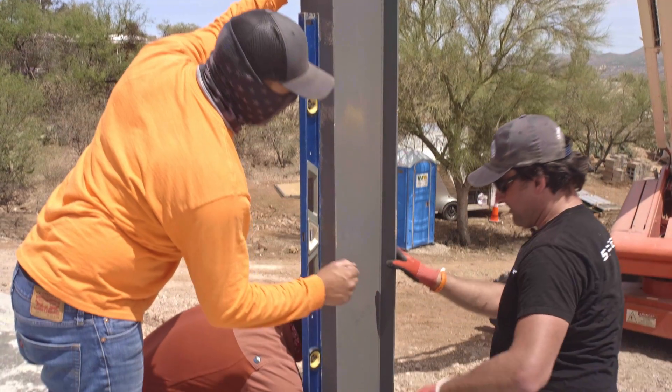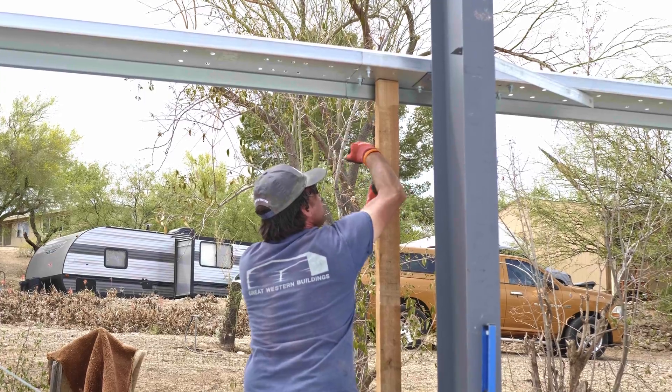I know my customers — some will say they can tell it's level enough and aren't going to rent a transit or laser. Fair enough. If your building is small enough — and this is not advised — you can set up your columns, install your girts, and check the elevations with a long level placed on the girt, then shim as necessary. Keep in mind that girts are not there to support any vertical loads; the eave struts and rake angles are what support the weight of the wall, and the girts are only there for wind loads. This means they can sag in the middle, especially on wider spans. To correct for this, run a string line down the length of the girt at the web, then cut some dunnage from shipping or a two-by-four to the exact length to place underneath the girt to force it perfectly straight. This is the most inaccurate way to verify your pads are level, but it is easy, and if the building lengths and widths are short enough it is a reasonable way to do it.